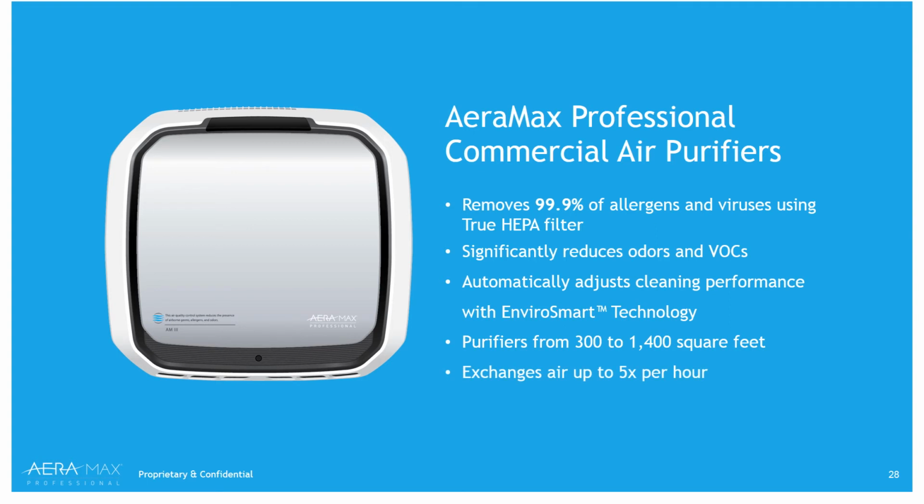And in all these areas, what we're aiming for is up to 5 air changes per hour. And this is critically important in order to achieve high levels of air quality within an indoor environment. If you set a machine to run at 1 air change per hour, you're really not going to do much more than what the standard ventilation or extraction system can achieve. But by using a minimum of 3 and up to 5 air changes per hour, you're really going to control and maintain a high level of air quality for your facility and for your occupants.